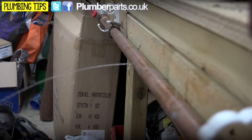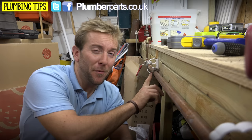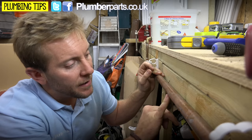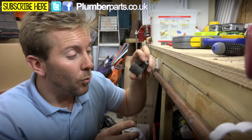Now let's have a quick look at pinhole pipe repair number two. The first thing we've got to do is turn the water off. I just want to reiterate that the fix we've just done is going to work pretty well on a gravity-fed system. If you're on mains pressure, just cross your fingers — because this isn't a proper fix, this is just getting you down to the supplier's fix. So we've got our next pinhole just here. I'm going to show you how to fix that now. What we need to do is find out exactly where the pinhole is. This is only really going to work if you've got pipework that isn't so completely ruined on the inside that it's going to fall apart when you put a pipe slice or a cutter on it.